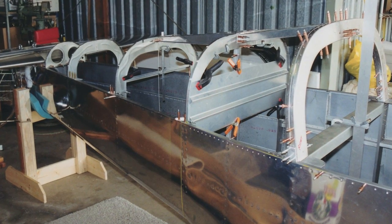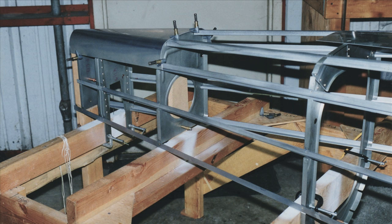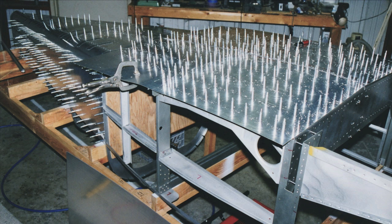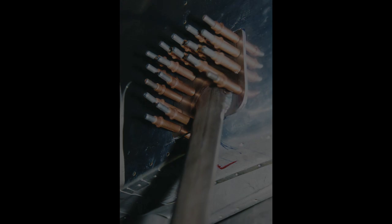The place where I would sit, the cockpit, was now defined and taking shape. I mistakenly thought I would be finished soon. October 1st: fabricated F6122 and angle braces, drilled most of the firewall. October 2nd: finished drilling firewall, drilled brake line 61222 bracket and braces, rounded bottom edges of forward part. October 15th: deburred and smoothed most firewall parts — not done, need dimpling.